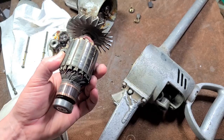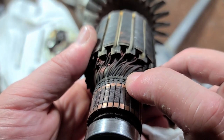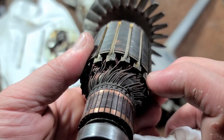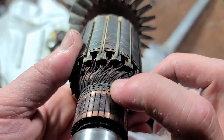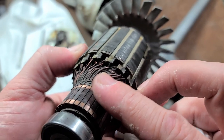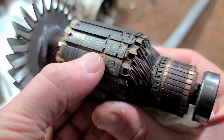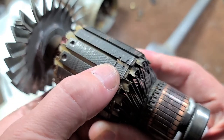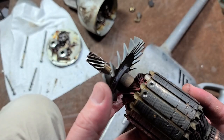There's our 9-amp motor. I was noticing you can see that some kind of rock or piece of debris was in there and actually did hit the wires — that's one of the reasons I kind of like older tools, because they do even more protection to prevent that from happening. It actually turns out it's pretty rare for debris to significantly chip the wires, but it did cut about halfway through. Interesting about this one: on older tools they use little pieces of brass staked in for balancing on one side, and actual drilling to lighten the other side of the motor — a combination approach — and then of course a steel fan.